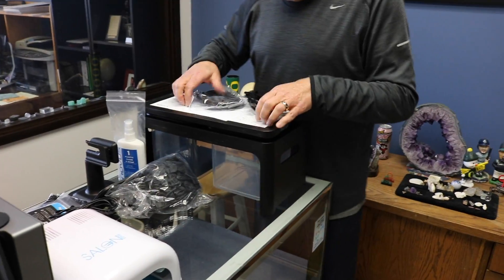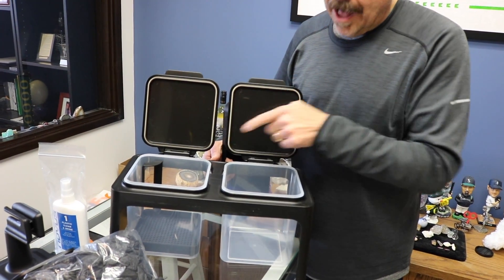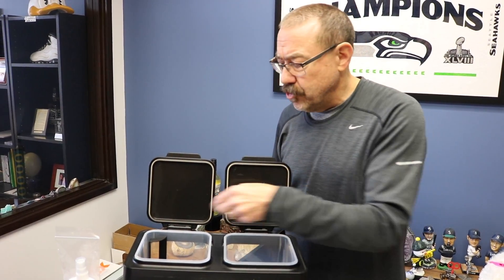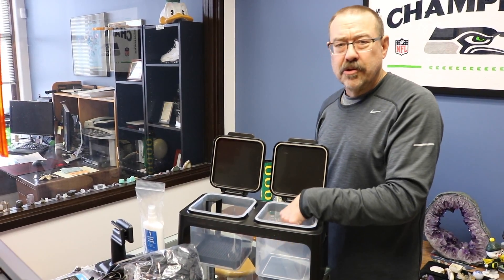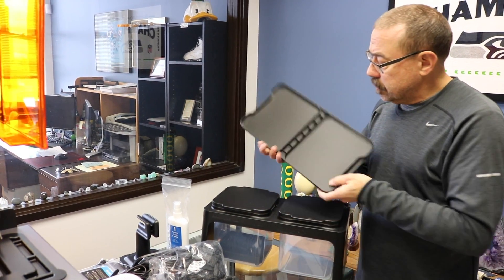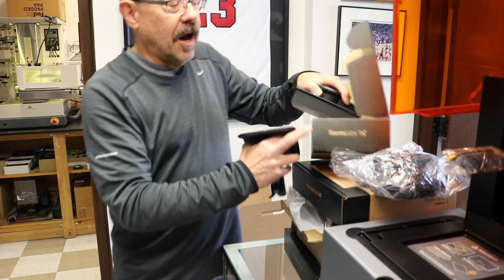After you make the piece, something else that came in the big box is this wash station. I'll put isopropyl alcohol in here, and that'll take a lot of the tackiness and stickiness off the resin when the piece comes out of the machine. You just put it in here, rinse it around a little bit, pull it out, and then do a second dip for the final cleanup. It's a pretty cool little unit that keeps everything clean.